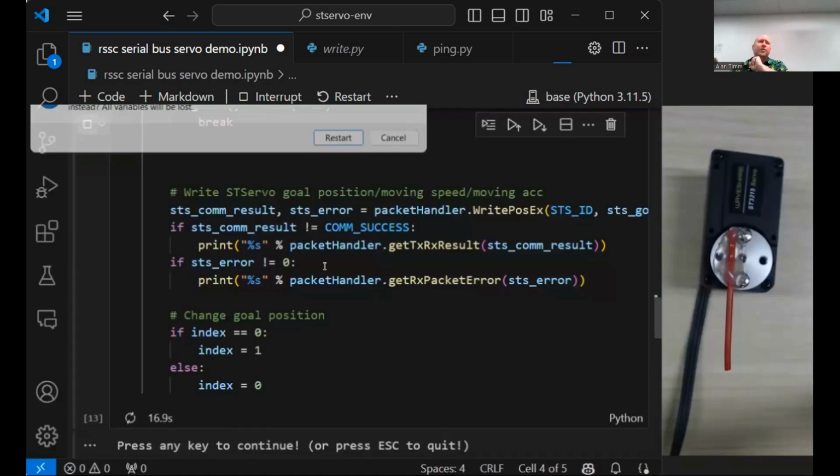Getting back to the more complicated ROS and the robot visualization in there, you're able to visualize the robot in ROS, not with the position that you send it to, but you can report back the position that it's actually at. You can see it move in real time because you're able to get that real time position back from the servo. So are you planning to close this in ROS? Oh yeah. Now that the hardware design is finalized, my workflow this time will be to move the Fusion 360 model into Omniverse, articulate it, set up all the joints, and then export that Omniverse formatted robot back to URDF.